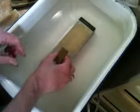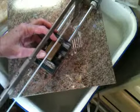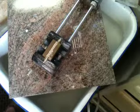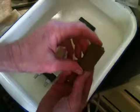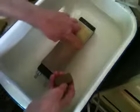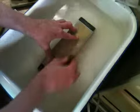The next step would be to take a stone like this — I have another one prepared right here. I set mine up in a stone holder, which helps quite a bit. Then take a fine-toothed hacksaw and cut a groove down as close to the center as you can, just a reasonable depth. You can re-deepen them as the stone gets worn out. Then we're going to take the stone and use the edge of the atoma — engage the groove on the edge and you're creating another 45-degree cambered edge.